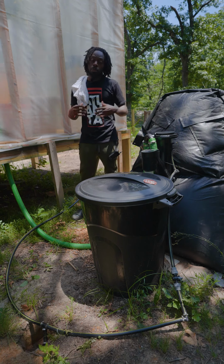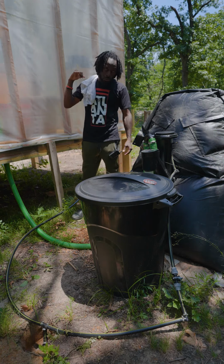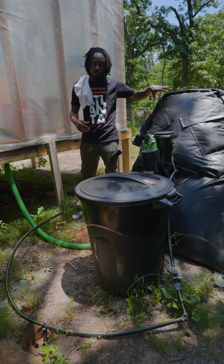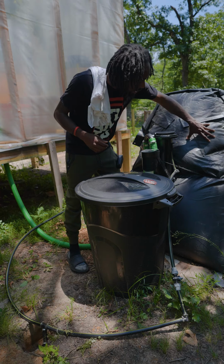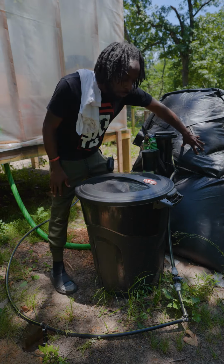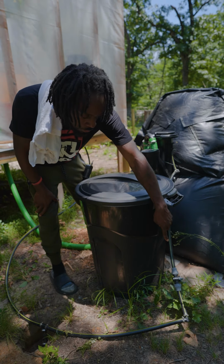In the meantime, what I'm going to do is connect the gas line to the tankless hot water heater that we have. So whenever we take showers, this is what's going to be heating up the water, all right? The gas line is connected to this portion of the biogas system, okay? It's going from the top portion of the biogas system, and right here is the shutoff valve.